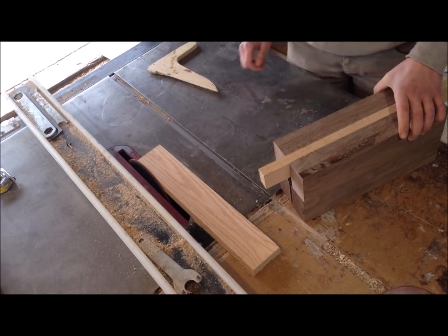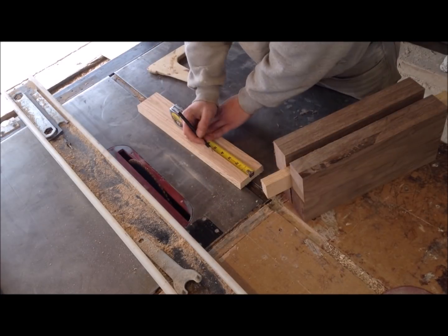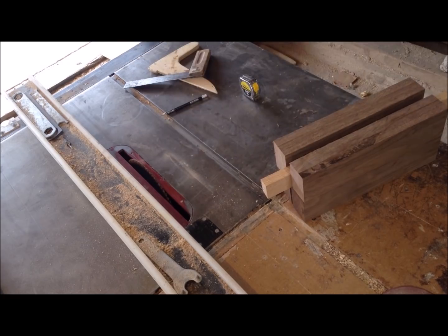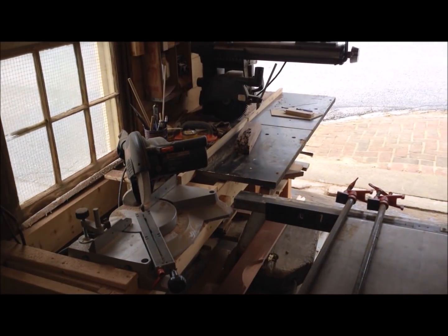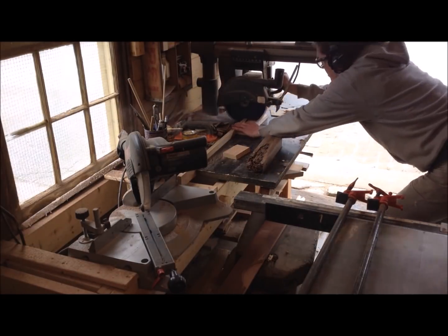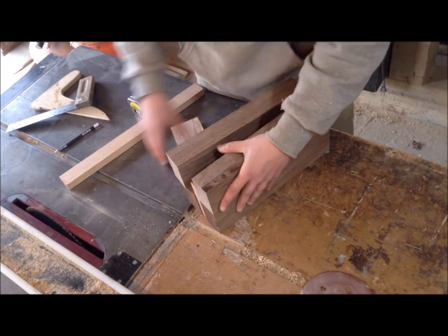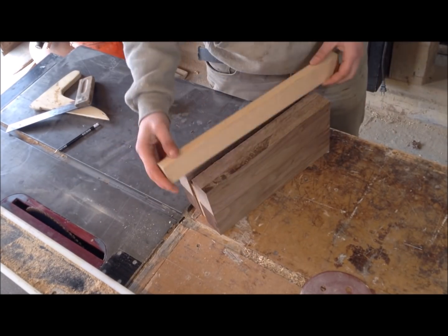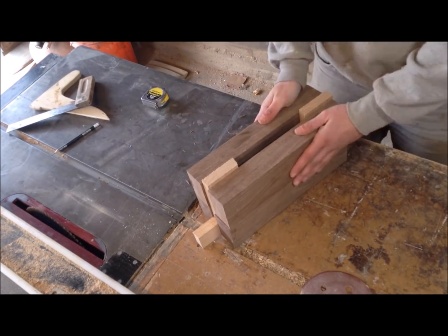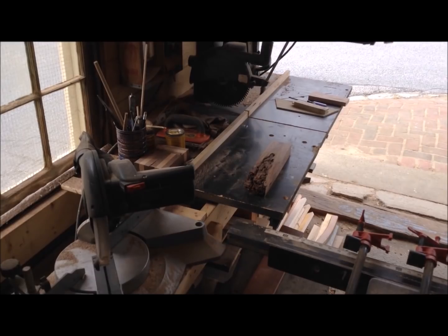In order to match the arc, I cut that walnut into 4 sections in order to get the height, and then cut them in half as well, and then I nestled some red oak on either edge. This base is going to have some weight inside of it in order to hold up the cantilevered action of that arch. So I made this big box, and I only put that red oak around the edges. So I started to create a recess on the inside.